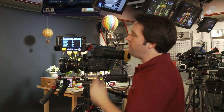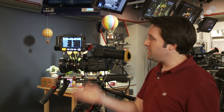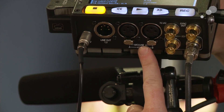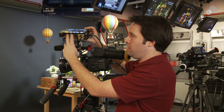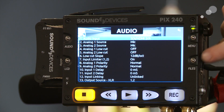In terms of audio, of course I have a huge number of features — this is an audio recording company. I have limiters, low cuts, delays, and so many more features, very important for anybody interested in really good quality audio. I can choose my sources being SDI or HDMI, or feed audio directly from an XLR input. On the bottom of this unit I have two XLR feeds — XLR 1 and 2 with a 5-pin out. This can be analog audio or AES-EBU audio, so I can feed up to four channels of audio that way very easily.